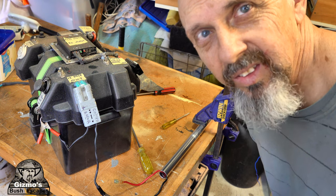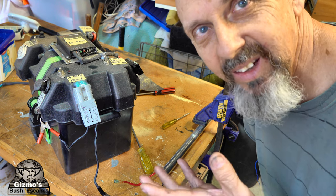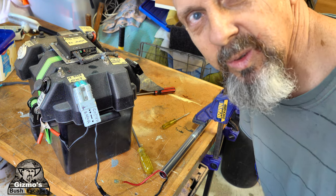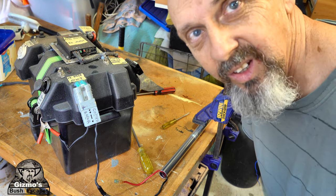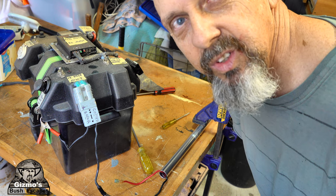Okay, well, here goes nothing. We're going to connect these two wires up. It's just directly wired straight now. The other thing to make note of is the polarity, the red and the black. Depending on which way you connect it to the battery, one will make it spin forward, one will make it spin reverse. So yeah, I need to check that and see which way it's spinning. I might have to swap the red and the black around when I do it. We'll see what happens.